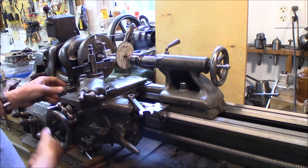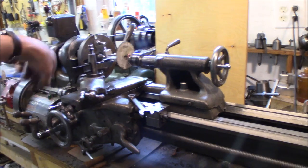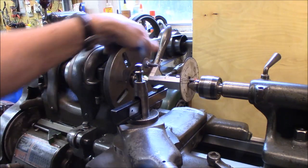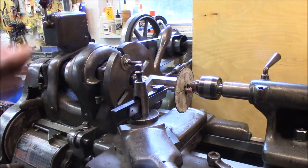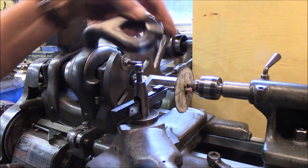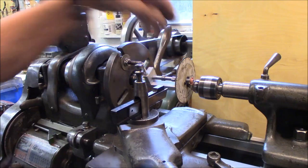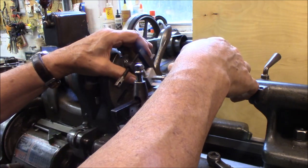You just need two stops so that you don't hit something you don't want to hit. To turn the CamCat, I'm using a faceplate with a drive dog. I didn't have a drive dog big enough to go over the CamCat because it's kind of big and awkward for a little lathe like this, so it just won't work with this drive dog. I think this is the way it was done in the article — I'm not sure what the safety people who constantly watch YouTube will say about this, but many a part has been made this way.